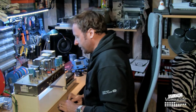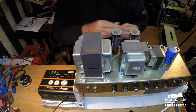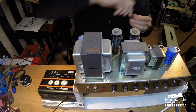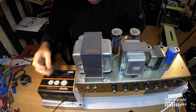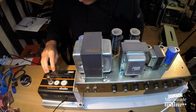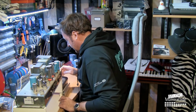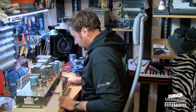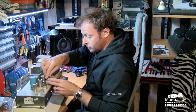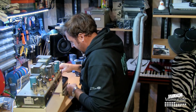classic Marshall. Second tube tested, it says an 8 and a 9, and it says good. Good to know. Replace it there. Trying the third ECC83. Testing of the third ECC83 turns out okay. It's a 6 and a 9. And when I say 6 and a 9, that's according to Orange's own scale, so to say.